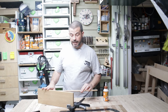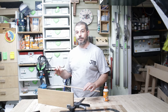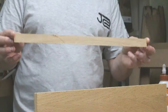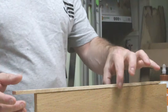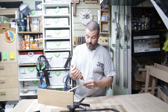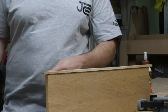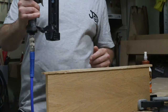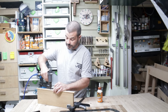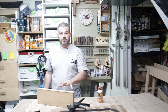When working with oak veneered MDF or indeed just normal MDF which I will be painting, I prefer to lip it. This is where we put a piece of wood onto the edge, hence lipping. I've got a piece of European oak here which is slightly wider than the material I'm working with. First off we're just going to put some glue on — I'm using normal Gorilla wood glue. If you're lucky enough to have a 23 or 24 gauge headless pinner, you just go ahead and pin it in place, then put it to one side to let it dry.